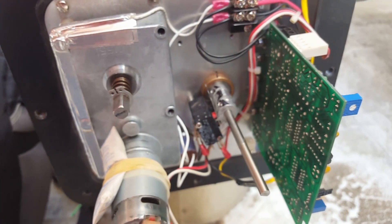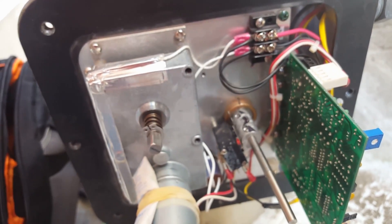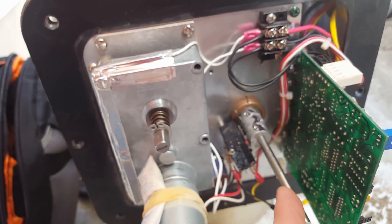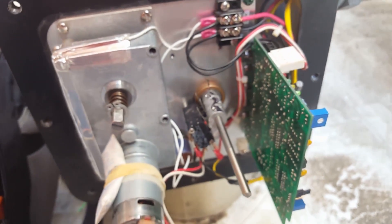I am not a big fan of this type of valve actuator. Any type of movement in those cams, and just some of the slop that is in that type of a system, does not allow these things to open and close as fully as they should be. With that adjustment made, however, you can see that we are currently not overflowing the tower. So that is going to help the problem tremendously. And again, this problem only appears when we are running Tower 1 in the configuration that we have it now.